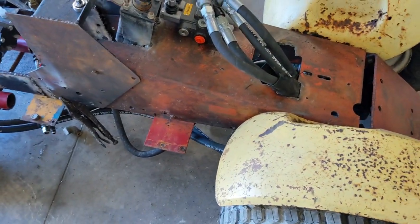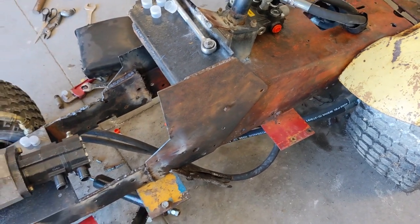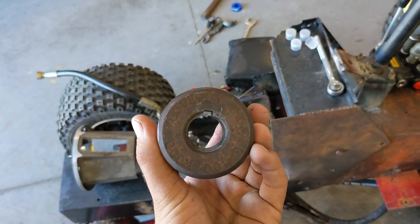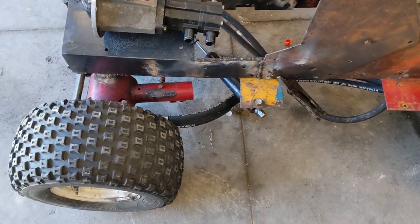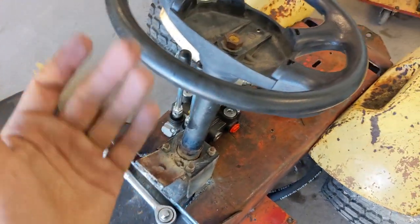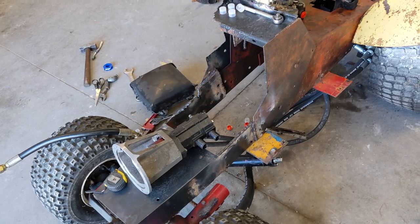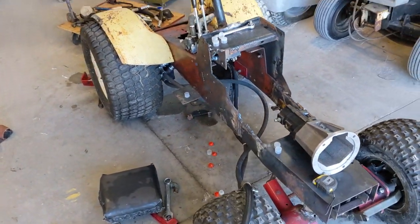The hydraulic hoses are in the way of the seat spring setup and I don't have one anyway, so I'm just going to make my own seat setup. I'm hoping I can figure out a hydraulic reservoir that can go right under here by the battery tray, underneath the frame, or somewhere. That's it for this video - I've got to figure out a coupler for the engine that's just like this one except with a one and one-eighth inch bore diameter instead of one inch, because the big engine has a one and one-eighth shaft. I spent two hours last night trying to find one and can't. Once I figure out the reservoir and this line, the next video should have me driving it. Let me know what you think in the comments - thanks for watching.